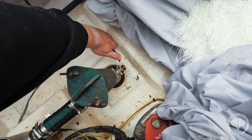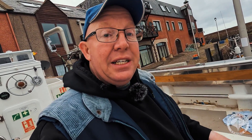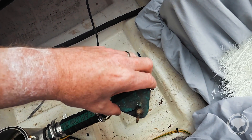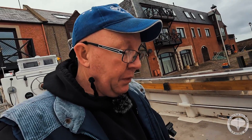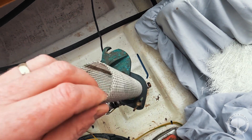Then obviously you make sure the ball valve works. Next step is inside the seacock — all we have to do is loosen the nuts off and open up the plate. Underneath the plate there should be a rubber seal. You can get replacement parts for this if needs be. The rubber seal will wear down after time, and the way you know it's worn is you'll start getting weepage. You can tighten up the lug nuts as much as you want but you'll still get weepage, so that means the rubber is needing replaced.